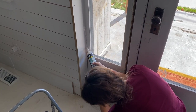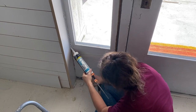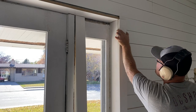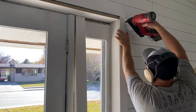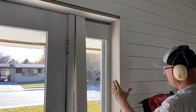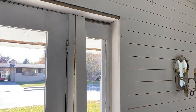This caulking gun is not awesome — it's not my good one. Where's the other one that releases the pressure? Now we're just doing the outside trim, flush with that inner face. This MDF trim has a little bit of wiggle, so if your wall isn't quite straight, move it around just a little bit — not a ton. We call that flex.